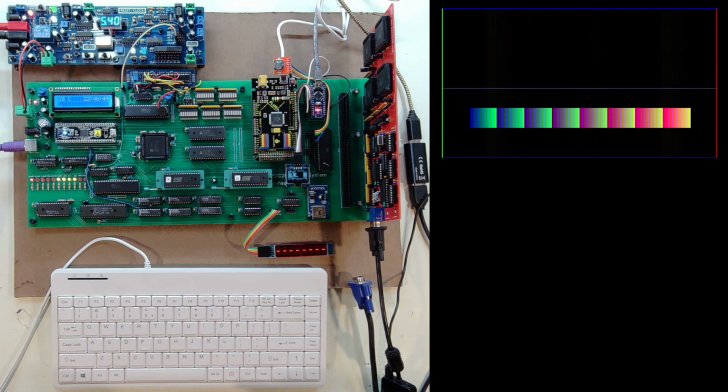And then that dark gray vertical bar is really where the first 64K ends and the next 64K starts. Remember, there's some memory at the bottom that I'm not using, and that's why that bar isn't quite in the center, because the first set of lines are 64K, and then the next is 64K minus 16, so whatever that is, 48. So you've got 48K of memory instead of 64K as far as the vertical portion.